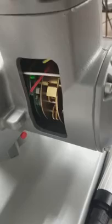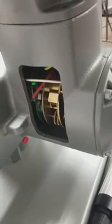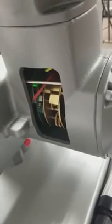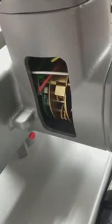Where the controller gets its information as far as the actuator position is in the electronic control unit. Those are always located in the actuator itself. They electronically monitor torque, position, and limits, and communicate it up to the controller. It doesn't need any power to save these settings, so if the actuator is powered off and moved using the hand wheel, it's electromechanical so it will always recall the correct position.